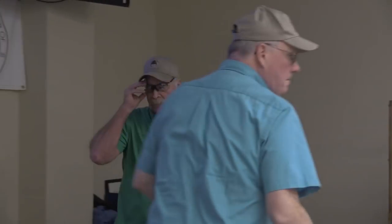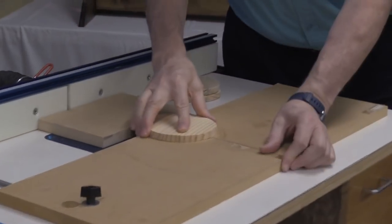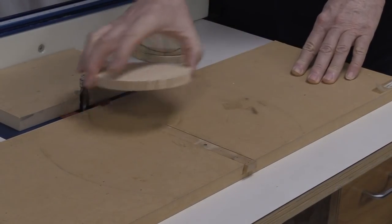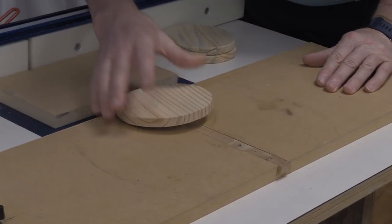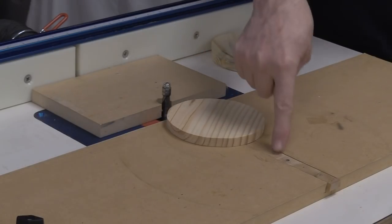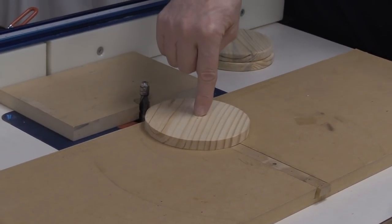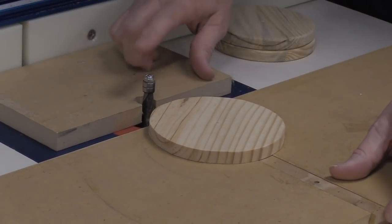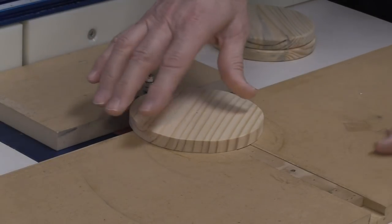So we just made a circle jig. What I'm doing here is measuring the distance from the bit to the center of this pin. This pin goes right there on top of that circle. If you look straight down this pin and this circle, it's easy to put them on the circle. I was actually shining a flashlight through this, looking underneath, and that got to be really tedious. But turn on the router, slide this in. There's a stop here that stops at exactly 5 inches. Run it through the router